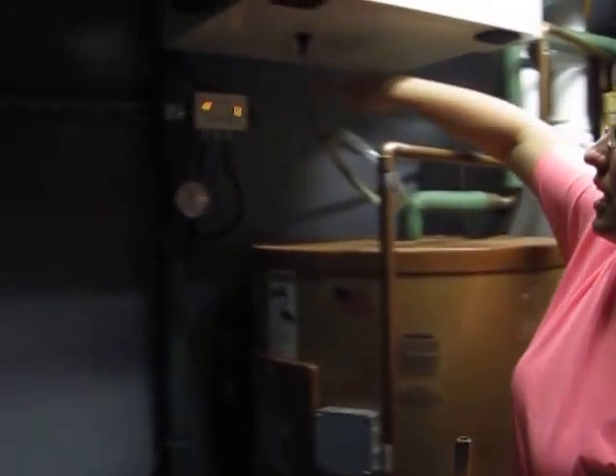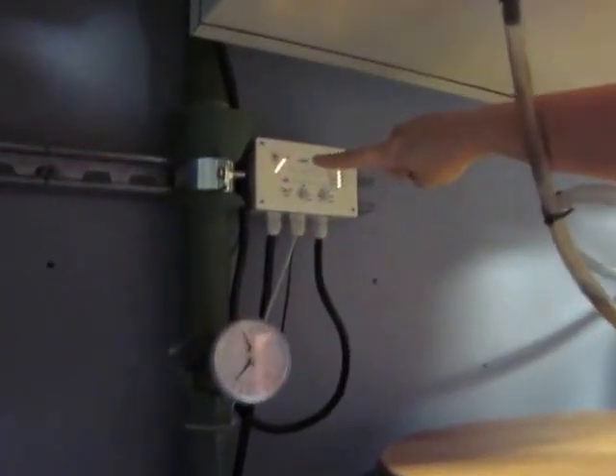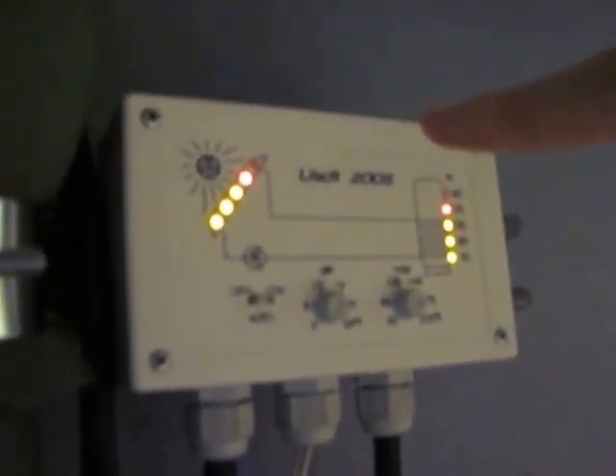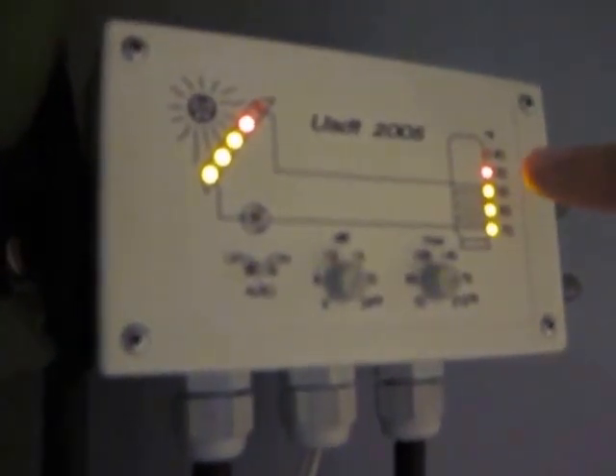If you look up over here, as I mentioned, this is the controller. Here's the temperature from the solar water panel outside — you can see it still has a red light, it's still fairly hot, but the tank is already up to 120 degrees. If we check the temperature gauge here, it's only around 100 degrees. So it will not run because the tank is hotter than the solar panel is.